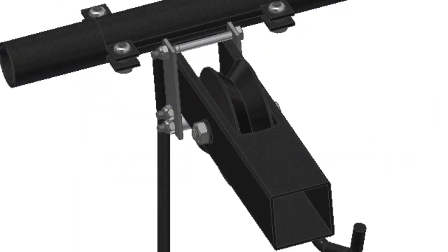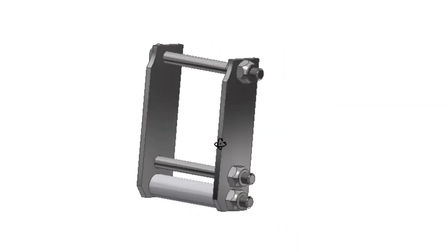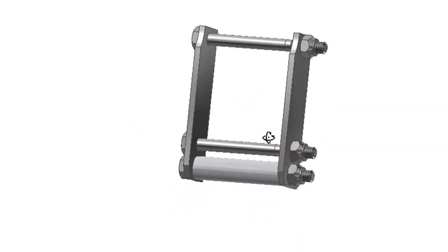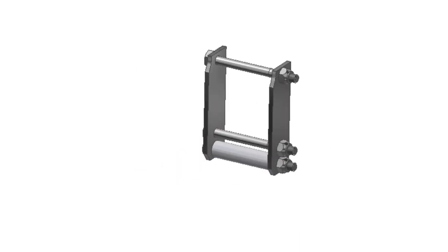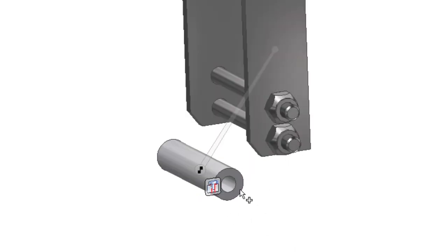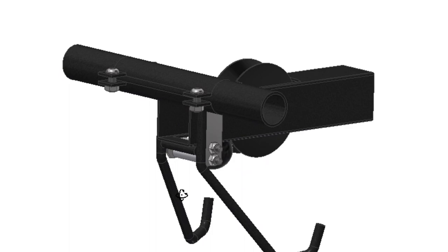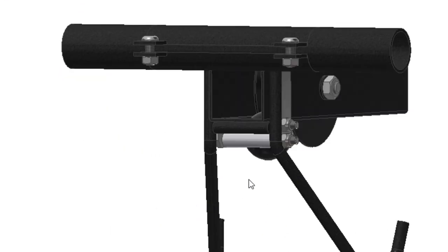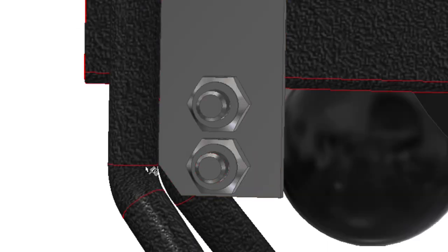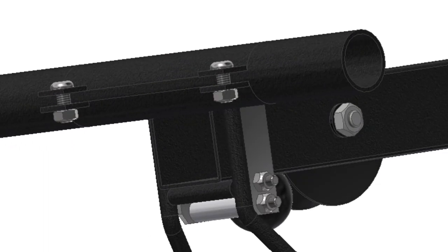Here is the top pulley area of the kit — I redrew it in CAD. Here's the prototype design: two simple brackets, three bolts, three nuts, and a roller. It bolts snugly around the square tube in this opening, and the two bolts tighten into the side brackets to secure it. The bottom bolt is just an axle for the roller, which rotates on the bolt. When installed on the rack, the roller is slightly below the steel bar, so the cable will roll on the roller and not the bar. The side brackets have a little chamfer on the bottom corner and a little radius on the top corner to clear the cage features.